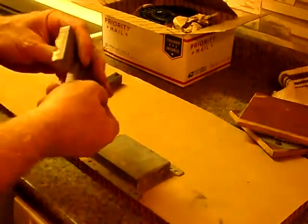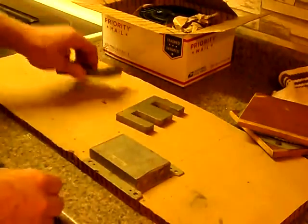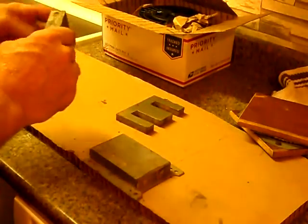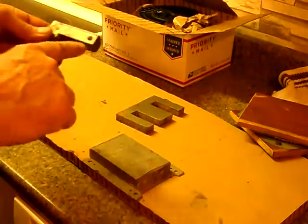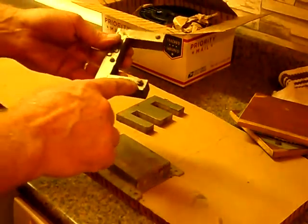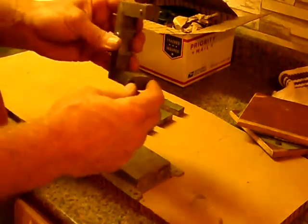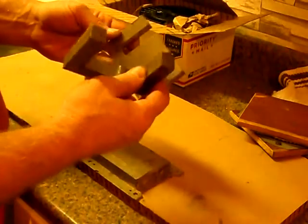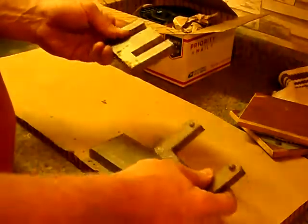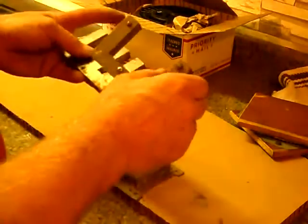And you'll notice there's welds. There's a weld there. Can't see it probably. There's a weld there. There's a weld. There's different welds on them to hold all these leaflets together, just lightly welded from the factory. But when you start getting rowdy with it and start cutting this centerpiece out, which is very big, a large portion of the transformer, you're going to end up with this all splintering on you, and you're going to have to drill some holes. You can put a nail in it later.